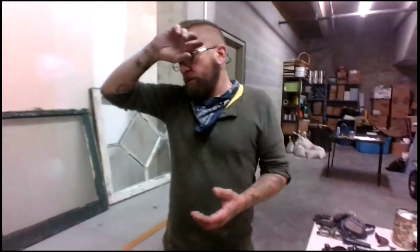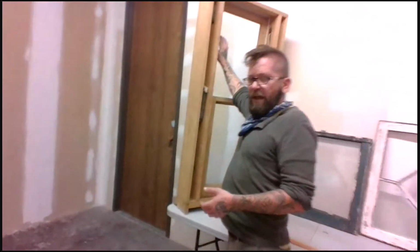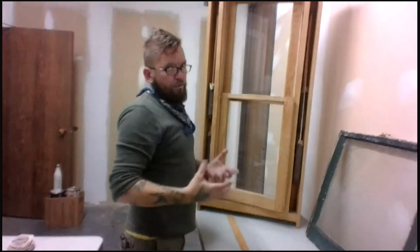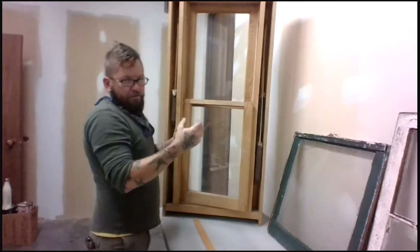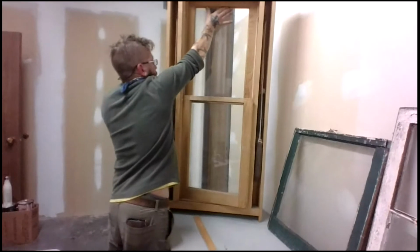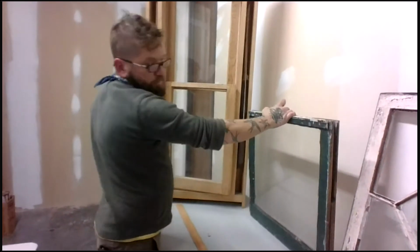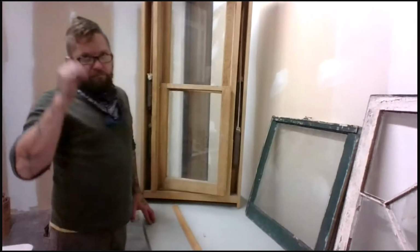Also, if you have a window that's stuck and you can't open the lock, a lot of times the upper sash might have loosened or come down, or a sash cord broke during the winter or over time, and the upper sash might have sunk a little bit. So always check that it's secured and as high as it can go. A lot of times that simple trick will release the pressure on the lower sash window lock, and you'll be able to turn it.